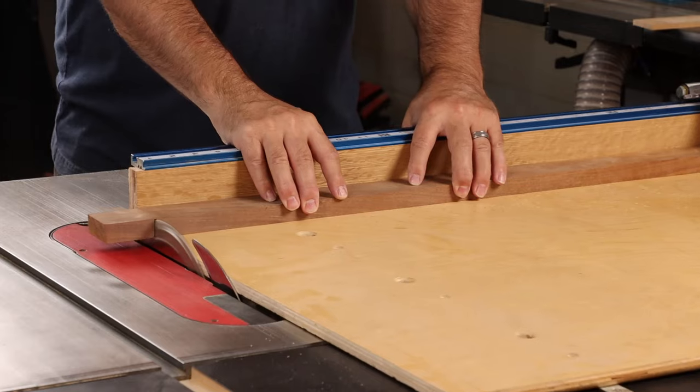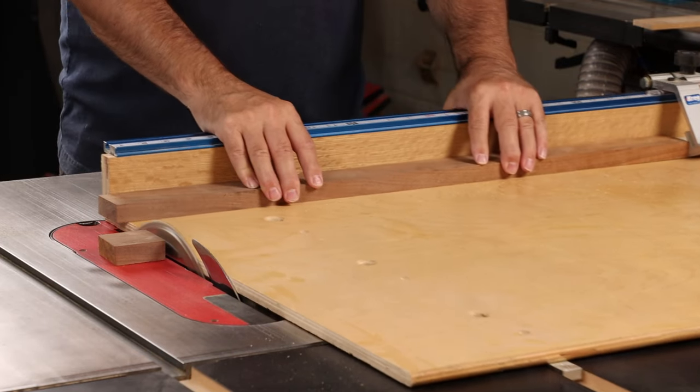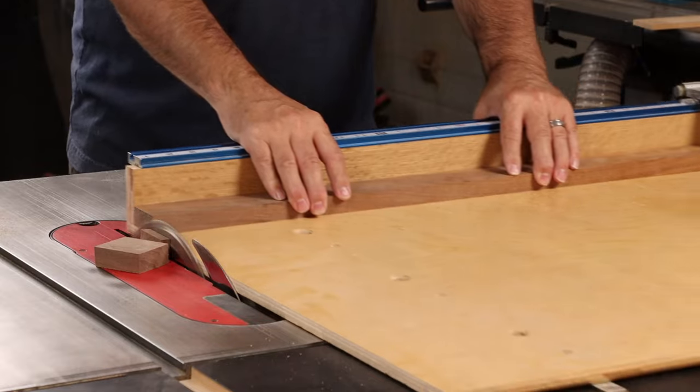The main disadvantage of the single-rail sled is that it doesn't support your off-cuts. What I've done to get around this limitation is to use a two-cut approach. Basically, you'll trim your workpiece to rough length — within about an inch of finish length — then reset your stop and make your final cut. By doing that, you'll maintain really good cut quality and won't get any splintering as the off-cut detaches from the workpiece.